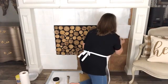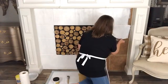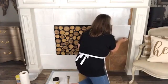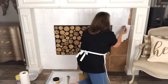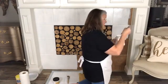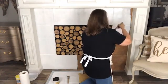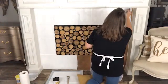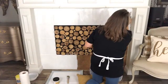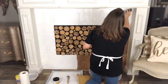Does it adhere to the grout? It does. It adheres to the grout very well. Like I said, I put 2 coats on the other side. I probably did not need 2 coats on this. Probably 1 would do, because it's not a surface that's going to get any traffic. If you were doing a surface like bathroom tiles on the floor, absolutely you'd want 2 coats, and I would roll it. I wouldn't brush it because it would take too long. And if I was smart, I would have gotten my roller out and rolled this, but I kind of tend to like my brush.